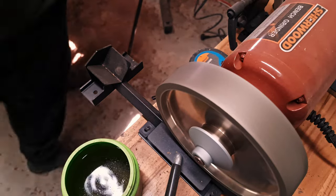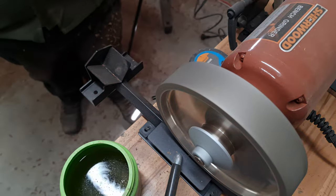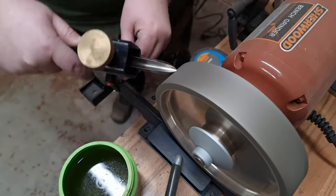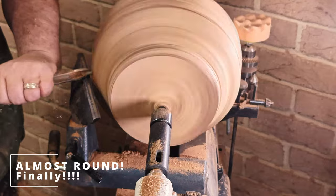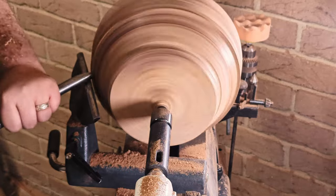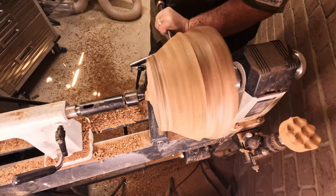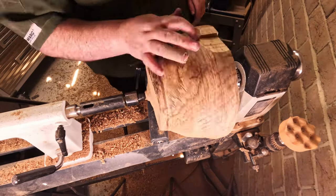Some people might be interested in the tool that I'm using. I am using a Crown M42 Cryo 13mm bowl gouge — I believe this is also known as a half inch bowl gouge elsewhere in the world. I am using a long grind, and that's because I like using the wings as a scraper. As I get closer to round I'm getting a bit excited because it's cutting a lot nicer. Here's a good example of when I'm using it as a scraper — you see those nice long shavings coming off, then I turn it around and use the nose, and then I go back to reshaping.